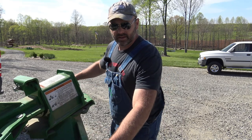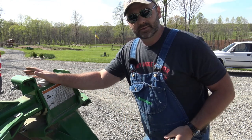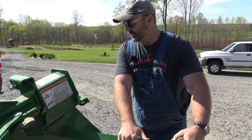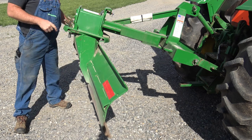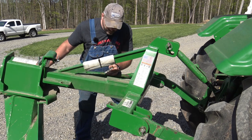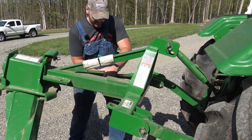First thing I'm doing is rotating my blade 180 degrees — I had the blade basically facing backwards and now it's no longer facing backwards. We also have to figure out the offset that we want. This Woods scrape blade has several adjustments; we're going to tip it up and we want the blade to dig in, so we want it pointed slightly forward and tipped down. I'll pull the pin out of the arm, pop that up, and slide the entire thing over. We want a good gouge here — we don't want to take too much land out, so we'll put it on about the second setting to offset barely. I need to put my gloves on so I don't pinch my hands — these things are bad about pinching you.